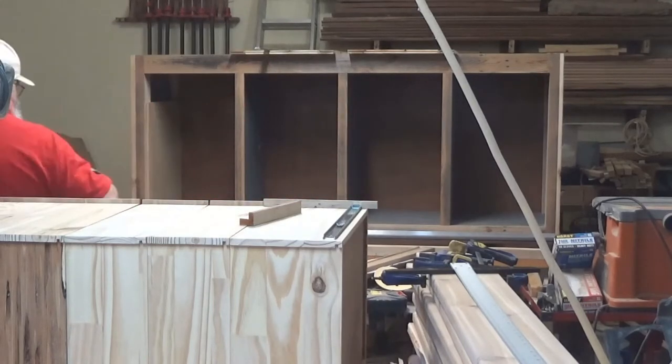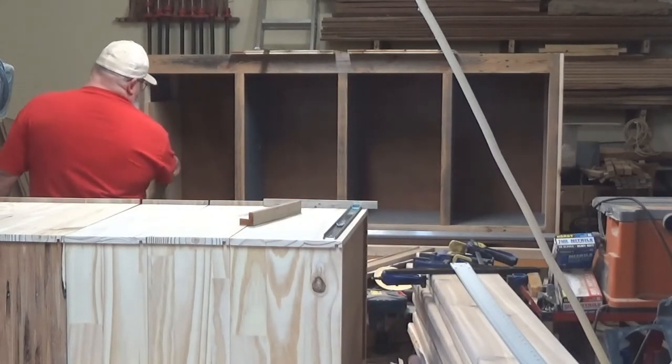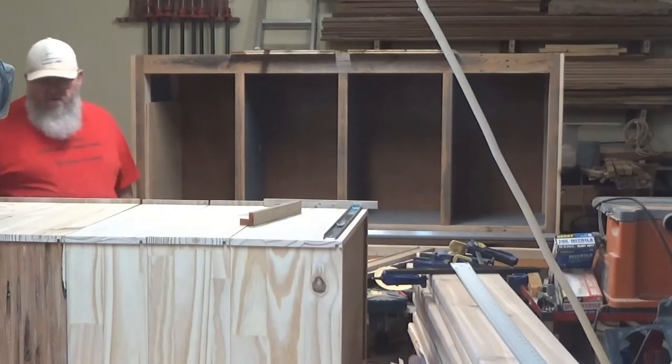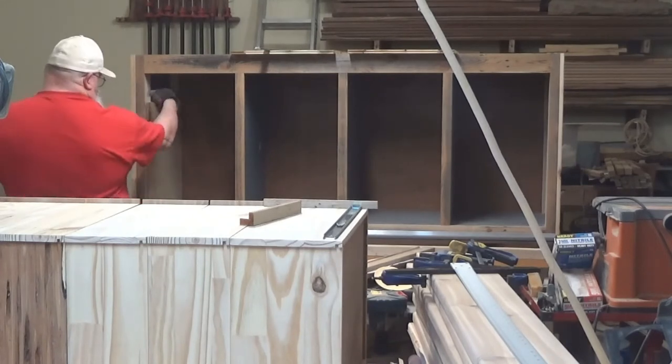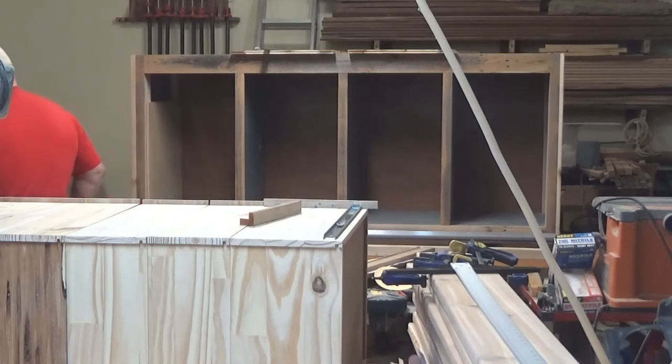First things first, I want to use this template. They gave me little short screws for installing these. It's not that I don't trust them, but I don't trust them. They pretty much have to be used on the drawer side because anything else would be just too long, and I don't want this going through the drawers. These are half-inch screws, and so that's just about right. Let's put the first drawer on and we'll see what happens. So I use 1¼-inch screws on the outside. On the inside, that's only 3/4 of an inch. Again, I don't want it popping through.